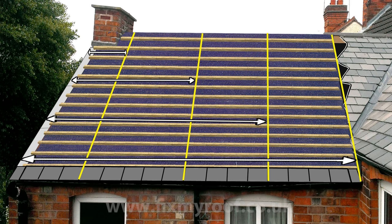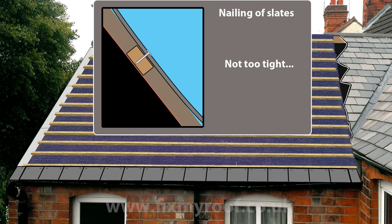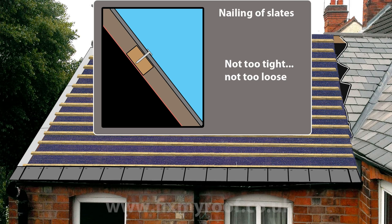When fixing your slates, make sure the nails do not penetrate through the batten out the other side and puncture your new undersarking. Another common mistake is hitting the nails too far home — this will stress, bend or crack your slates. Or if you have the nail too proud, it can puncture the slate above at a later stage. What you're actually looking for is the nail head to just touch the slate without applying any pressure to it.